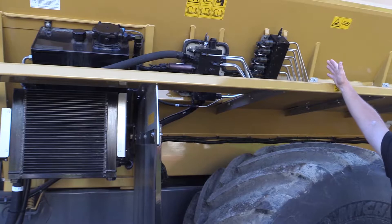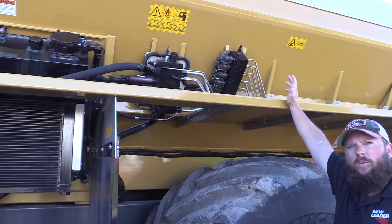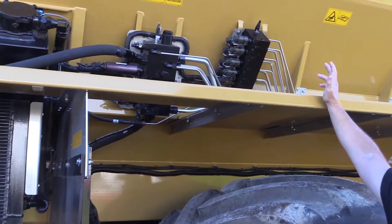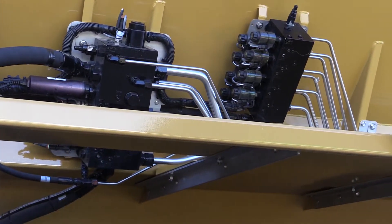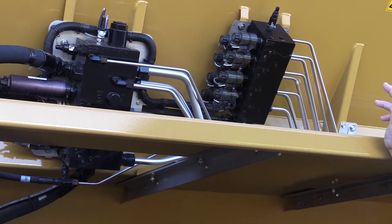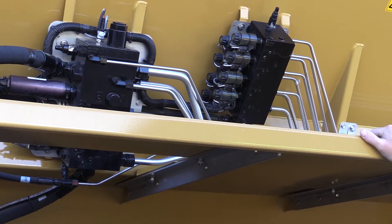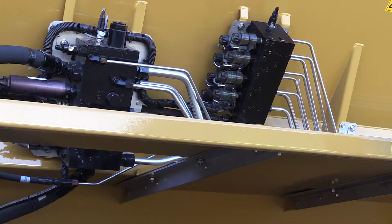We'll move along to our G5 manifold where we house all of our PWMs for our cylinders, which would be on our feed gates, on our left and right for our spinners, and fore and aft for our spinner frame. All of that's housed right there in that manifold — pretty easy to get to, pretty painless little system right there.